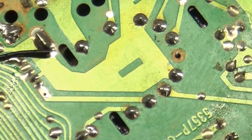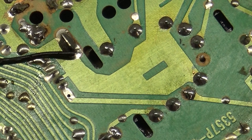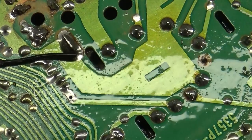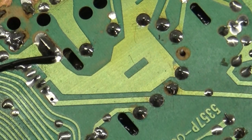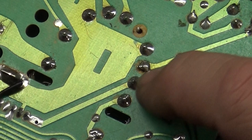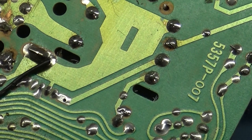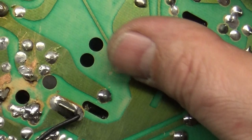And you can see just how much better that is right there. You want to take your brush and clean off all of the flux residue that's on the brush. Then we're going to do another quick round here, then we're going to dab this. There you go. Nice and clean. Nice shiny solder domes, except for this monstrosity here. The pad was half gone when I took the original one out. There's not much I can do about that, but otherwise it'll be fine the way that it is. It's a pretty easy process, and you can see how much better that is.